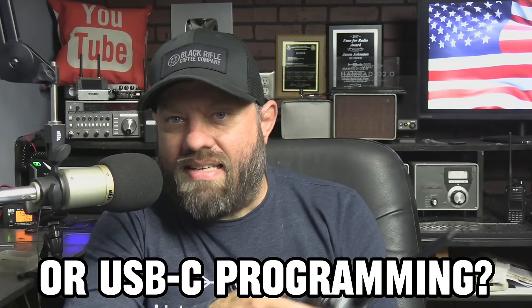This video you're watching right now will premiere the day before Orlando Hamcation. So while I'm at Orlando Hamcation, I'm recording this a few days prior, I'm going to look for a programming cable for this radio. It's just a standard K connector on the side, so I think you could probably use the standard Anytone cable or just any standard Kenwood K connector cable. This is a Kenwood radio using a Kenwood cable, what a concept. I don't know if it requires an FTDI chip or a Prolific chip or no chip at all. So we're going to get to that eventually.